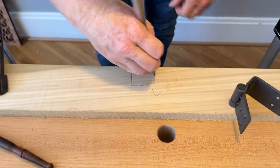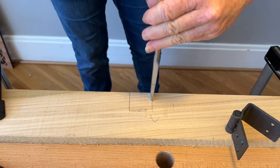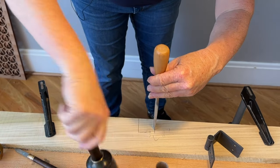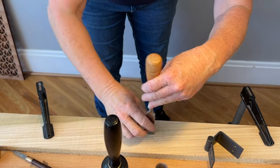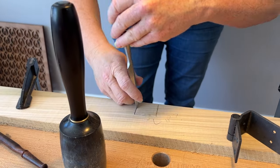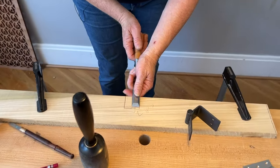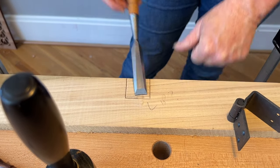Having deepened these lines, I now have a little bit of room for the bevel to fall into as I deepen them further — because I've got that V-cut there. So now I can hit a little harder all the way around. I've got my chisel straight up and down. This is one of the few times I'll use a larger chisel — I don't like to try to displace a lot of wood with a wide chisel even though it seems faster, because it really isn't.